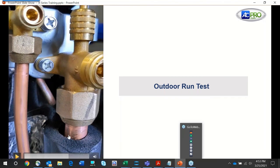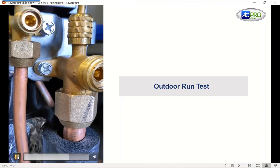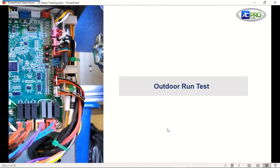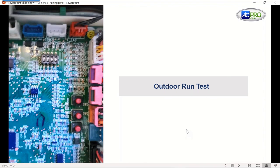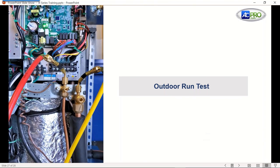Here are the valves: on this 3-ton unit they come from the bottom of the unit about 20 inches, and then you've got your flare nuts. The flexible connectors — check with your TM or the store for pricing to see if it's worth buying those or just becoming proficient at doing flares, because they do add some cost to the system. Here's the board — it looks complicated, but all the brains of the system are right there. That's what's doing all of the moving, changing, flow, metering, and everything.